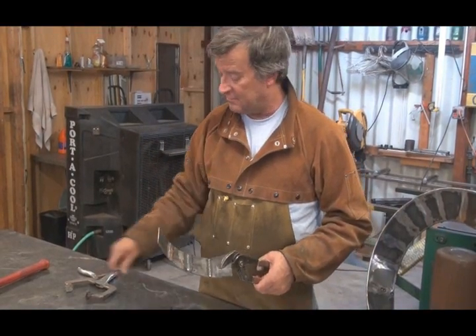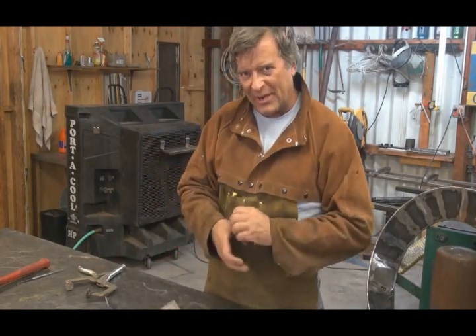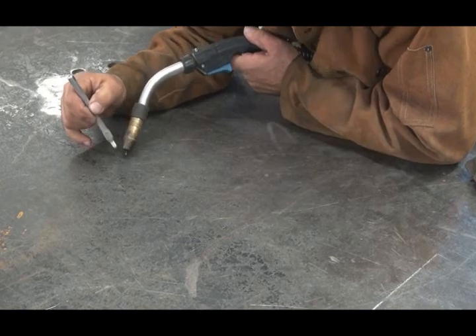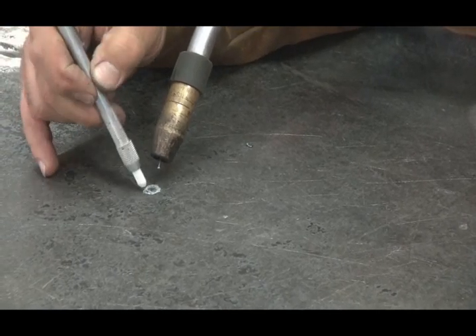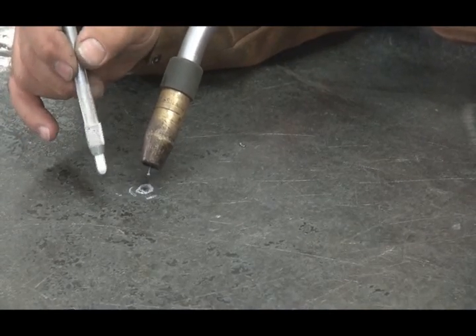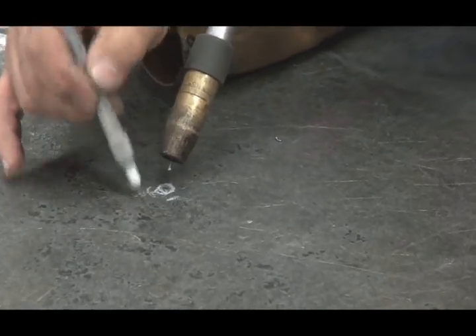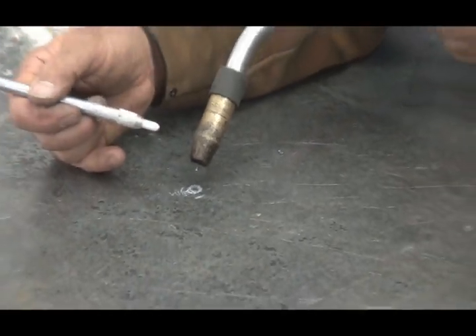So how do you know when you're welding, though? That's when you really need to know if you're getting penetration. Well, I wish you guys could see what I see when you look through the lens. When you're sitting there with your gun and you're trying to lay down a bead, your weld is going on right in there — that's where the big bright spot is. You can look on either side as you're moving forward, and you'll actually see your base metal getting pulled away, getting eaten away a little bit because it's being pulled down into your molten metal. Pay attention — look in that area and you'll see it's starting to actually pull that metal off. You'll see you are welding, you are melting your base metal, you're adding some filler metal. That's welding.